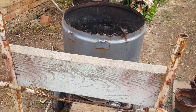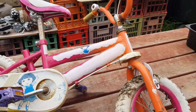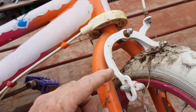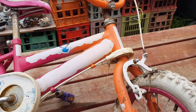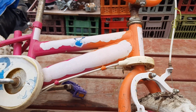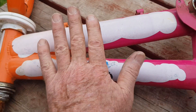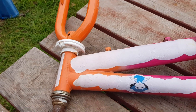This is very much experimental at this stage. I'll have a hunt around the yard and see what I can find to make a bracket. The best I can come up with is this little kids' bike — the steering head will give me a good swivel, and the fork at the bottom where the wheel goes through will give me an area to rest a pole through. It's going to be pretty rough, but I want to be sure it works before making a proper welded bracket. I'll just cut through the main frame with the angle grinder to get a fairly flat surface to bolt to the timber.